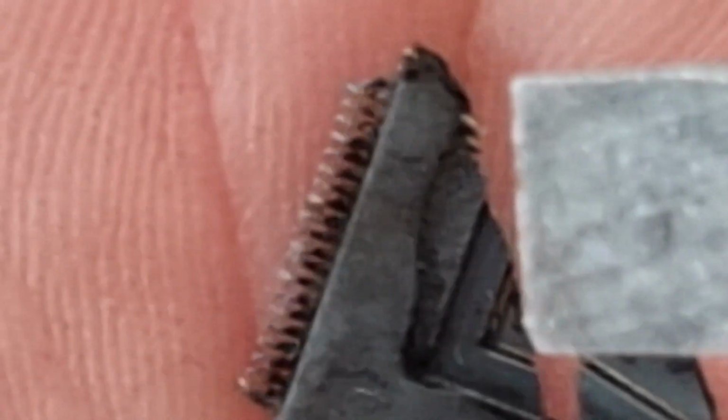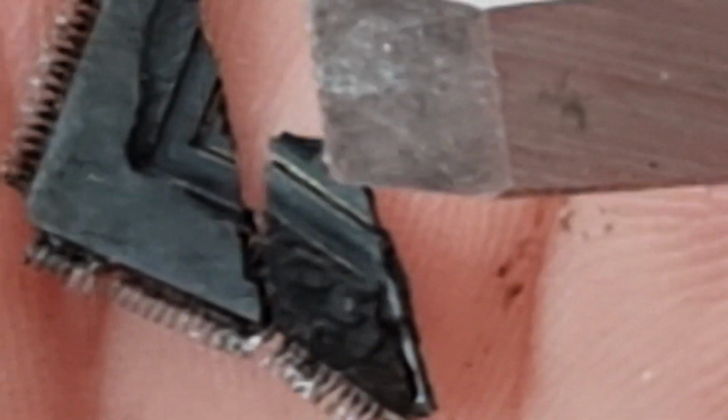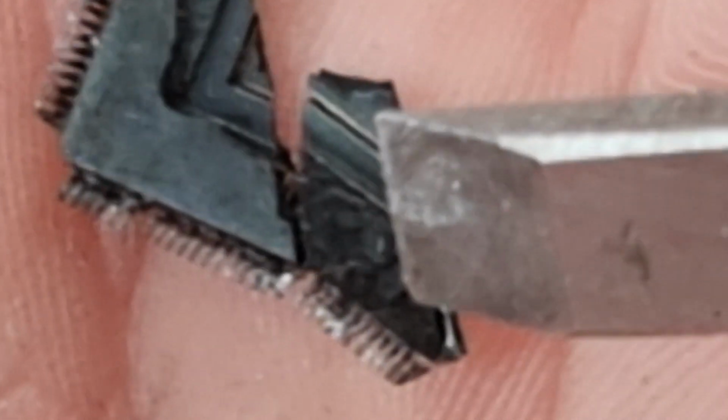You can see there at the tip, there's a line that runs along, and you can just about see the gold protruding through it. Along that line there, over and up, where that edge is, you can see gold pins or gold bonding wires protruding from it. I should have left this down on something that wasn't moving. Even though it doesn't look like my hand is shaking, when it's zoomed up it is. But you can see that line there. That is gold pins or gold wires protruding out, and again, you have it over here. Each one of them wires on the outside is coming along, changing to a gold pin or a gold wire somewhere in here, and then carrying on out.